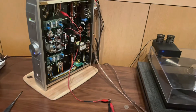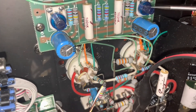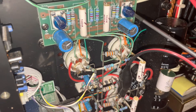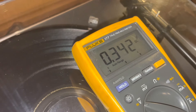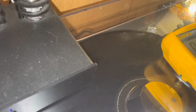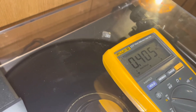The thing you need to change is the little blue pot — it's just hard to do one-handed. There's a little blue pot right there next to that capacitor and those two resistors. I'm going to put my little screwdriver into it right there. If I turn it in one direction it goes down, and if I turn it in the other direction it goes up. You just want to bump it up — it's pretty close to 0.4, we'll stick with that.